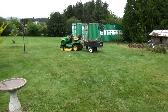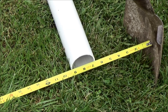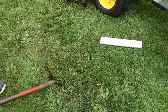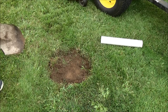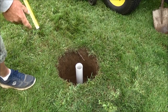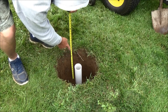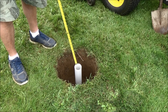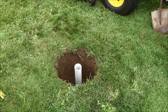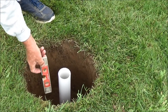So I picked my location. We need 6 inches on each side of that plastic tube, coming to 16 inches wide. There's our hole — they call for at least 14 inches deep, and right down here is 14 inches. The pipe is going to tap down a little bit, but it's sitting pretty good right now. I just need to level it. Leveled.